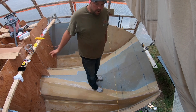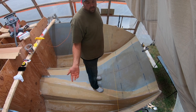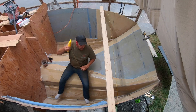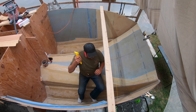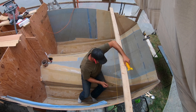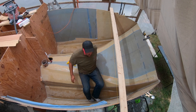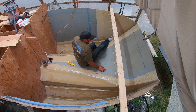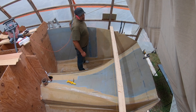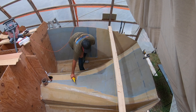I made my mark. The plumb bob was right on my measurement, so I want to make my mark with that string, not this one — it's not much but it'll throw it off a millimeter or two. I'm sure I have a little bit of play here, but we'll try to get it as accurate as we can. Cassie is inside trying to edit this week's video. Our hull was leveled after we loaded off the jacks — we put the level on the bridge deck, on our forms and saddles that hold the hull up right now. Everything looked pretty level, pretty close, and I'll definitely double-check everything before we install the bulkheads.